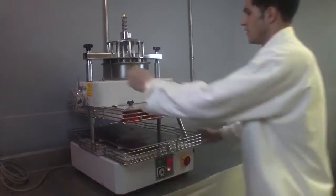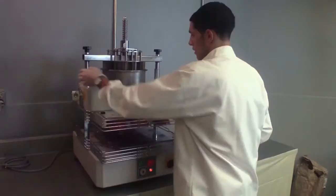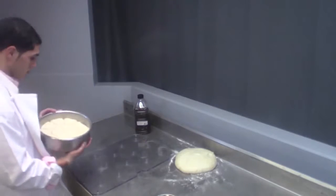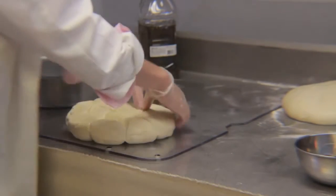To release the pan, push slightly forward on the lifting lever with your right hand, disengage the handle lock lever with your left hand, and raise the lifting lever up. Remove the pan from the machine and place your cut dough portions into the receptacles on the dough tray.